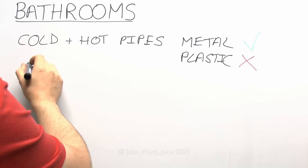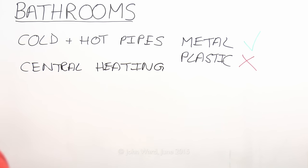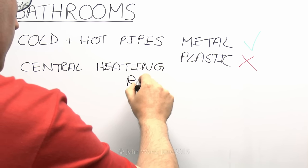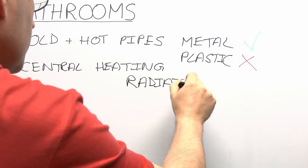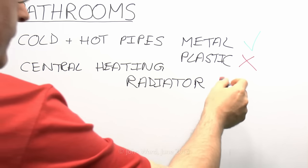Other items included would be your central heating — a radiator or a towel rail or perhaps both. It depends on what kind of piping has been used. The radiator itself is not an extraneous conductive part because it's fully contained within the room. Although it's certainly conductive being made of metal, it's not extraneous — it's not hanging half out of the wall into the landing. In general the radiator is contained within the room, so it's not an extraneous conductive part and no bonding is required.